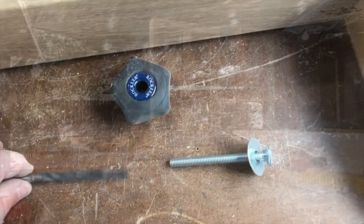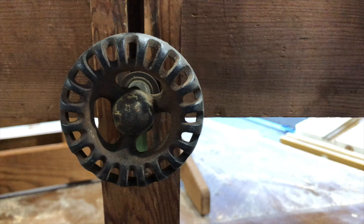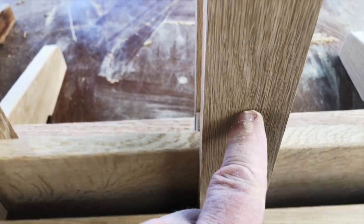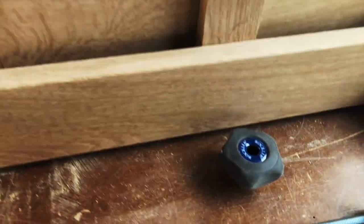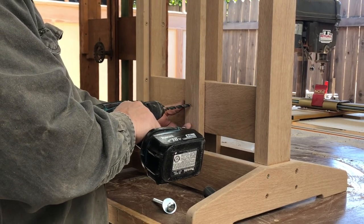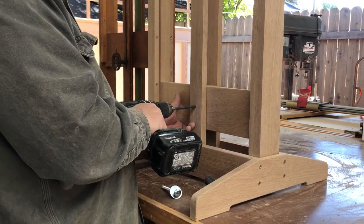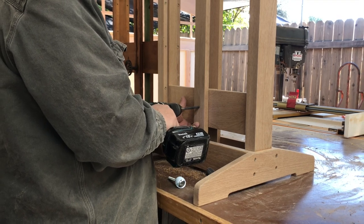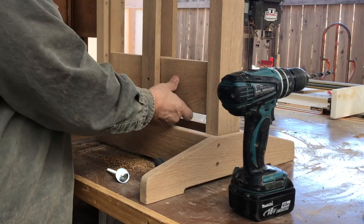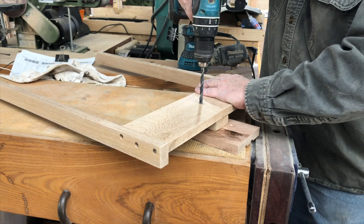This is the knob and bolt that I'm going to use to cinch the pieces of wood together. Look at the old knob on this original piece - that's solid brass. I'm going to drill right there and use that as a point where I will start the slot. I'll probably use a router to cut that slot, but there's more than one way you can do it. I want to make my slot long enough so that the throw or reach of this sliding mechanism will give me a full 48-inch extension. So first I'm going to mark where that slot will begin by drilling a hole through this first piece of wood and then just slightly into the second piece, which is the stretcher holding the sliding sides.